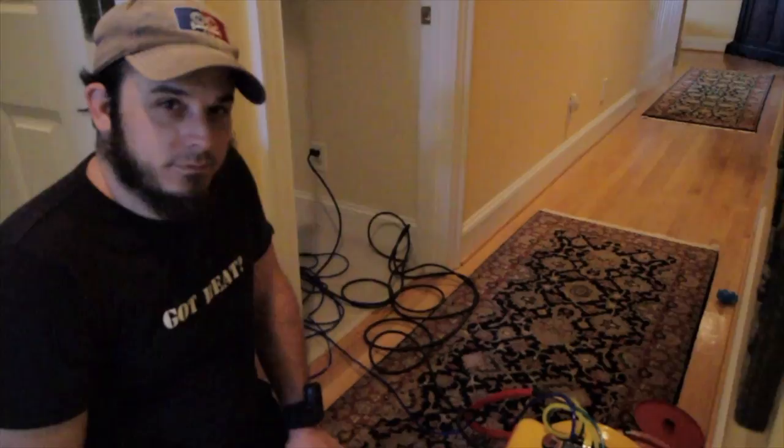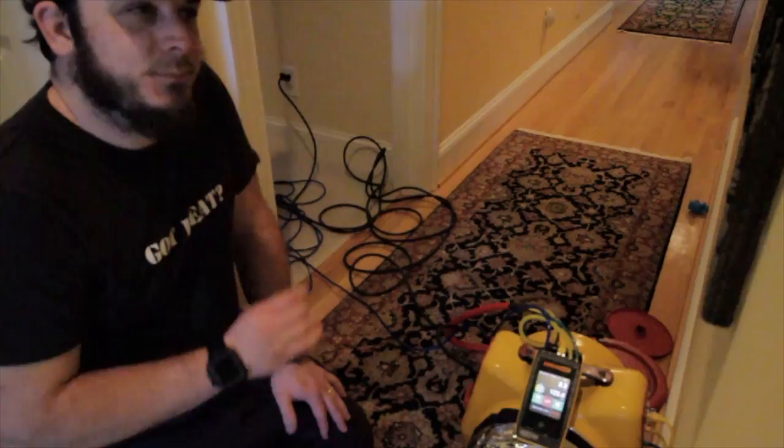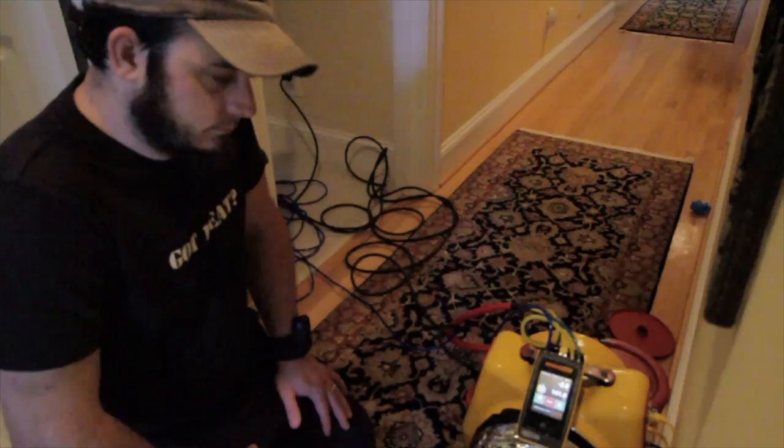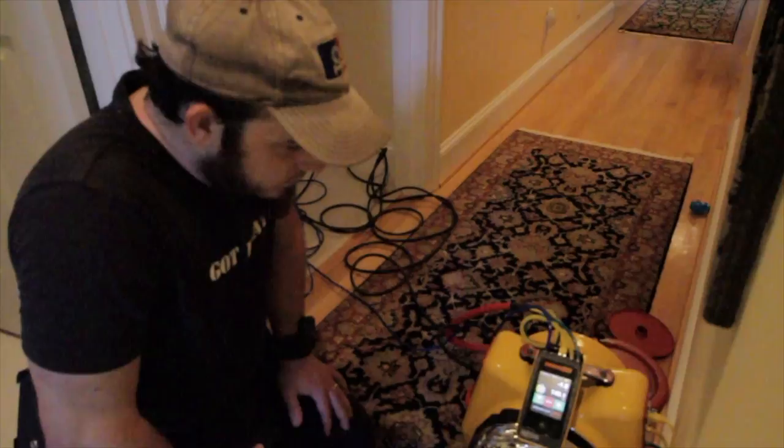All right, so we have the blower door set to 25, and we're going to set pressure to zero and hit enter, and this will give us our total leakage. This will give us our leakage to outside in comparison to total leakage. Which is interesting. I may need to go back to the mid-ring for this one, because I think we'll probably be able to get it.